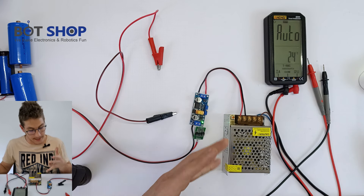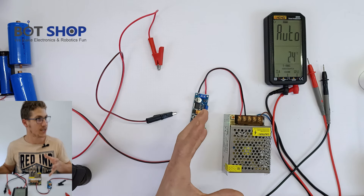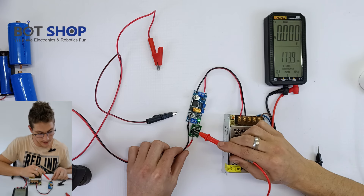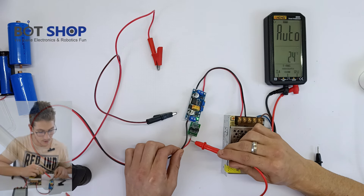On our output side at the DC level, we can measure the voltage — it's going to be at 23.61 volts, which is perfect for this application. From the positive and negative of this power supply module, I've connected to the input side of my constant current driver. You'll see there's written 'in plus' and 'in minus'. At 'in plus' you go with your red wire and 'in minus' with your black wire. You can solder them or use the screw terminals provided. I do prefer soldering as it is more sturdy — there's no way these connections are coming loose.